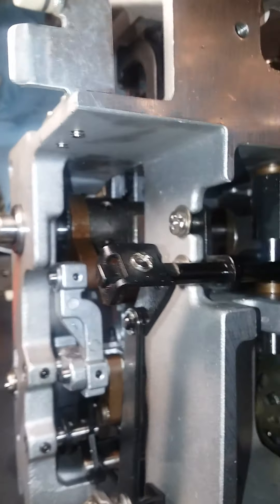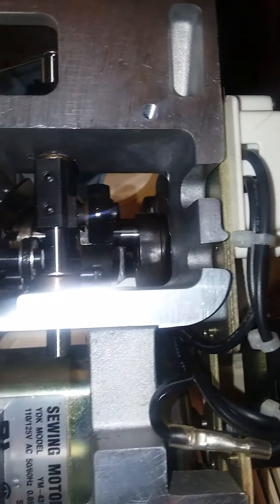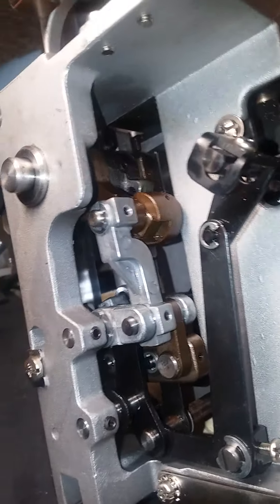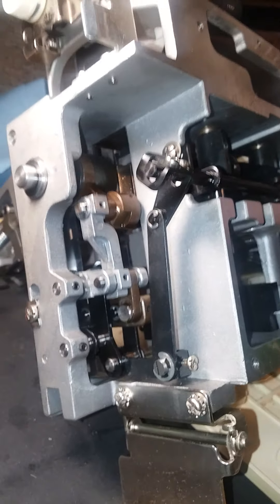This thing probably sat for a minimum of a decade, either outdoors or in an unheated and un-air-conditioned shed in North Carolina. Each of those little points needs oiled. You might not want to do that while it's under warranty, but if your warranty is up — and this baby is old enough that its warranty was up ages ago, I'm sure — you need to figure out where everything slides and moves together and get oil in each of those areas.